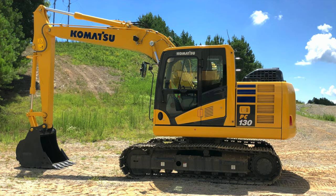Beyond giving the PC-130-11 true mid-sized power in a smaller package, Komatsu made it a priority to build this machine for long-term durability in a construction environment. This is really the first way you can tell this is not a value or economy machine, even though it is aimed at saving certain contractors money. The key to understanding the PC-130-11 is that it saves you money through right-sizing — a more realistic, more durable, and more powerful right-sized machine at the bottom of the mid-sized lineup. The PC-130-11 features steel castings in the boom foot, boom nose, and arm tip for spreading working loads away from those high-stress areas.